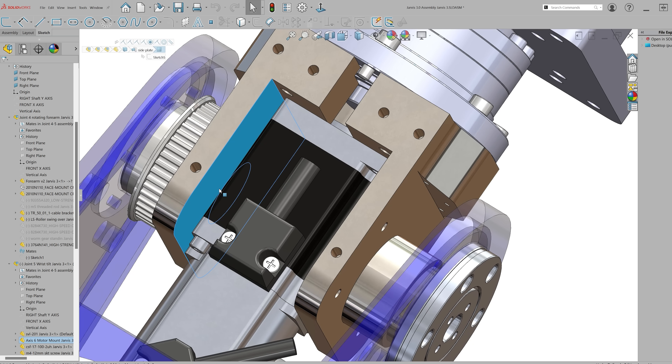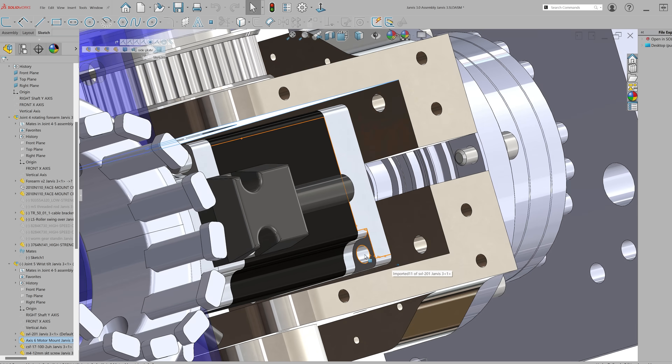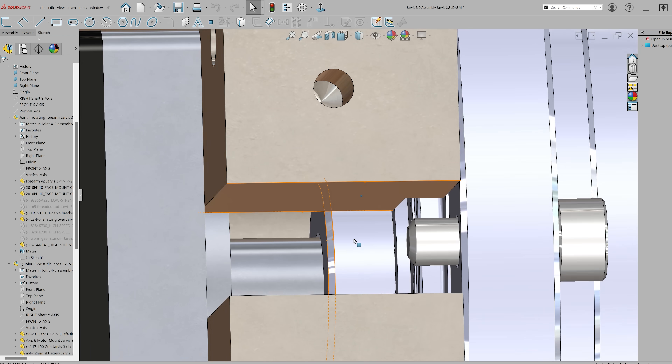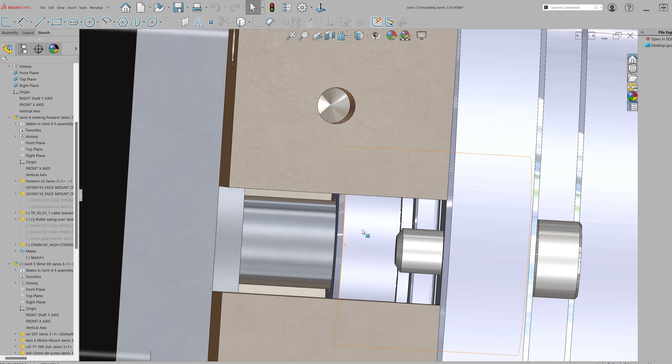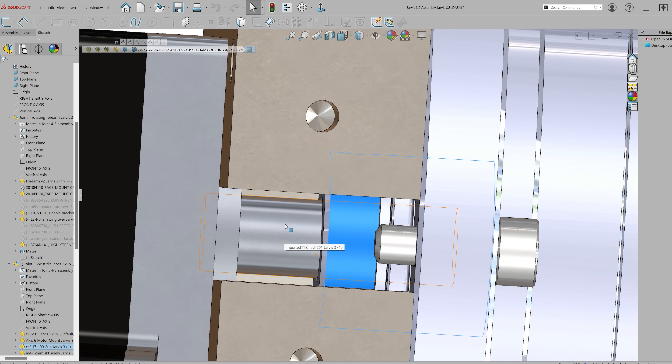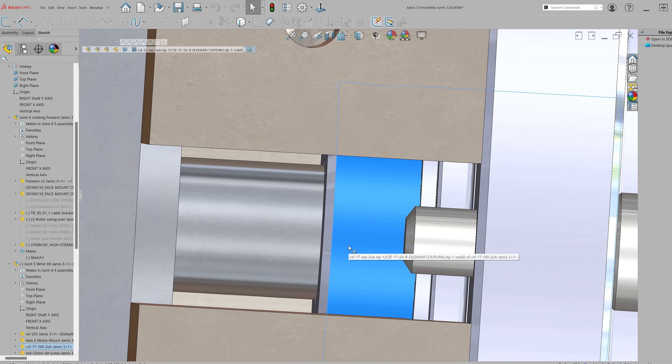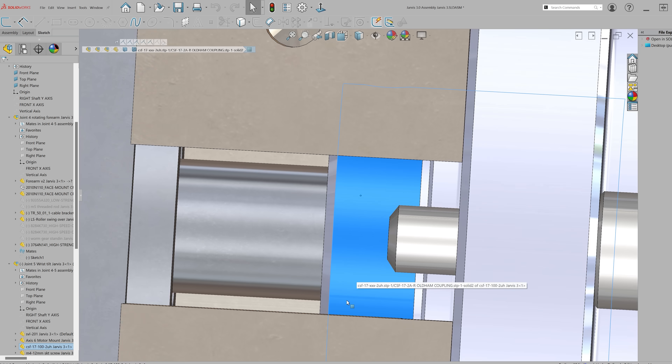One of the tricky parts was I wanted to be able to assemble and disassemble this thing without too much trouble, but I also wanted it to be one part. That's how I ended up with this recessed pocket here, which allowed room for the head of the screws. This big hole on the other side serves two functions: it serves as a locating hole for this giant pin, but also provides an access hole to machine features buried on the other side. You want to think about not just how the part will function, but also how it will be manufactured. I needed to be able to tighten the set screws on this harmonic drive connecting it to the shaft after the whole thing was assembled. So I cut a keyway in the shaft, which allowed me to push the set screw all the way down into the keyway. Now it serves two purposes — the bottom of the keyway serves as a flat spot for the set screw, and the side of the set screw can serve as a small key, so the relationship between these two always stays in sync.